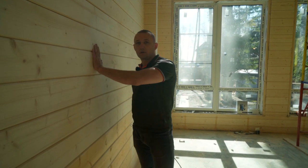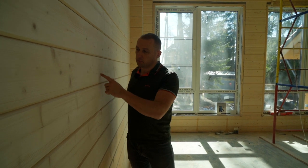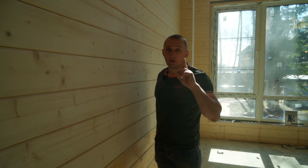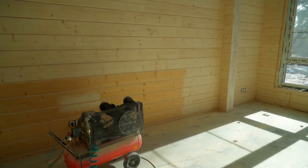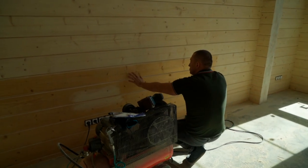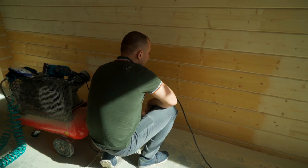You should understand that whatever type of wooden house you have, it needs sanding — the walls should be prepared. The wood gets compressed under the cutter of the machine, any type of wood, and for the product to stick to it, it has to be sanded. Also note: it stood for half a year and got yellowish. We left those spots on purpose for you to see how yellow it gets. If you paint over it, the color will mix in. So these yellow spots are to be sanded off — only then can we paint and get the exact color the customer wants.